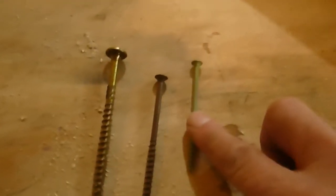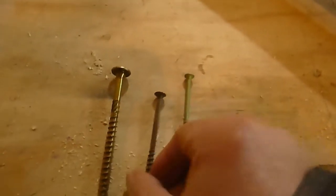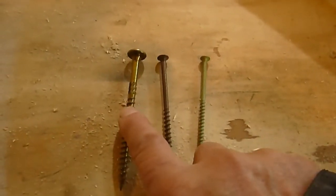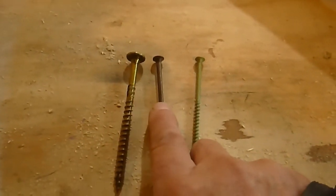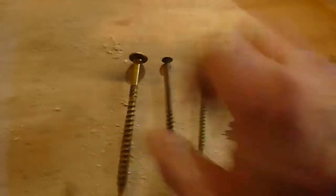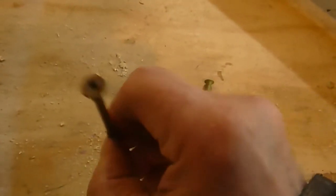Initial screws are 3 inch by number 8. I screw it onto the wall with two of these guys on the bottom and that guy on the top. And that's in 3.5 inch number 10. And this is 5/16 by 4 inches. That's Torx head, and since I'm in Canada, that's square head Robertson.